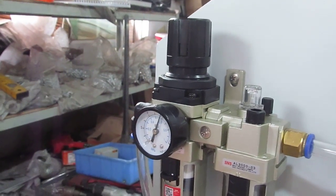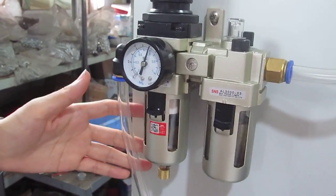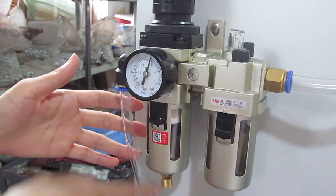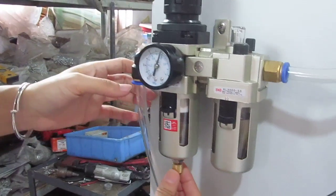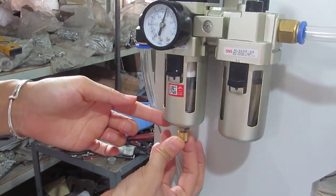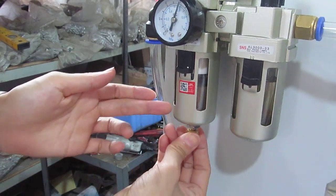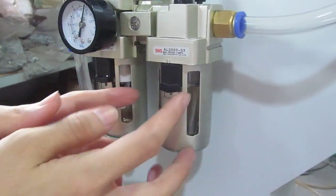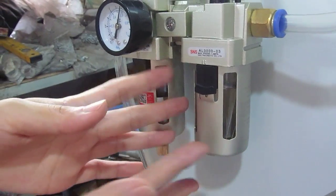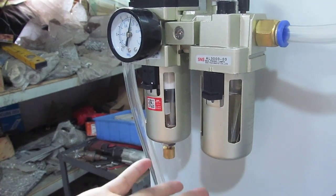After long time use of this machine, we have to release the water from here. The water comes from the air compressor pipe. The filter — the band filter — just press this, and the water will come out from here. This is the cylinder oil. Once it is finished, you have to fill it up, because the oil helps the cylinder work well.